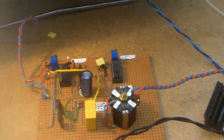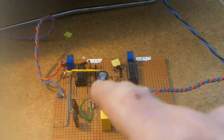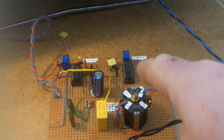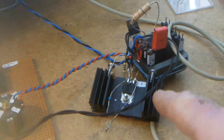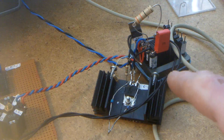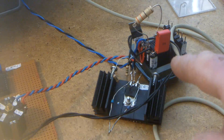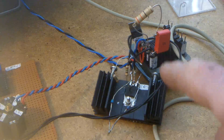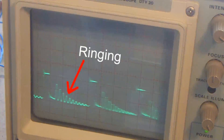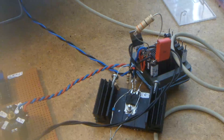The pulse is added. That's a 40-46 phase lock loop — I'm just using the oscillator to drive into a rising edge trigger that I'm using to set the pulse width. That's firing into this little bird's nest here. It's a bit like a switch mode power supply, but it's just a little transformer that I've wound — I'll put the circuit at the end of this video if I remember. I've killed that ringing that I showed you in either the last or the one before video, so I've got a tidier output.